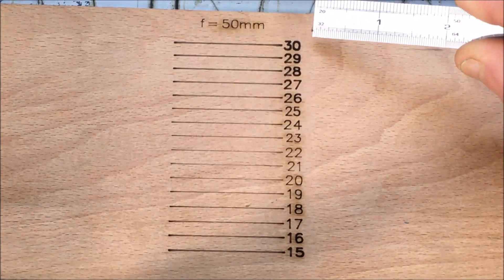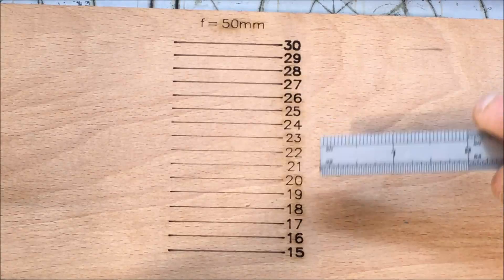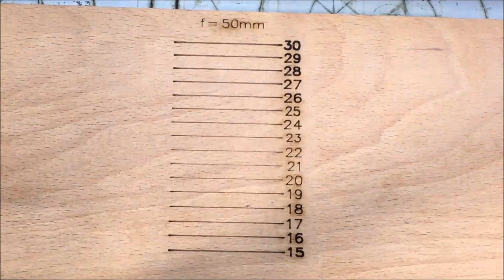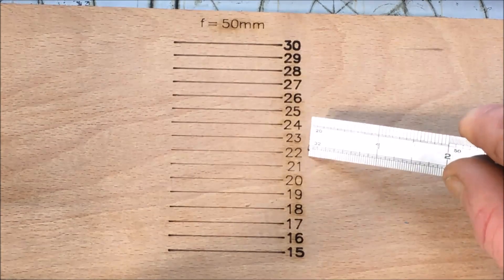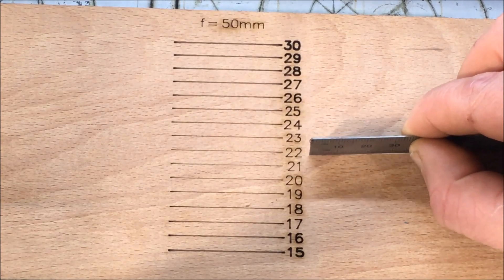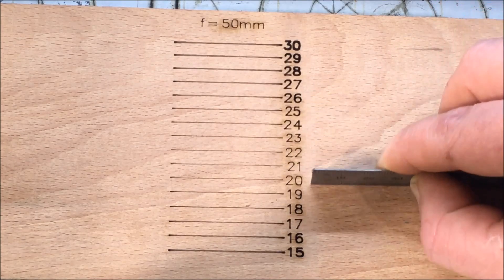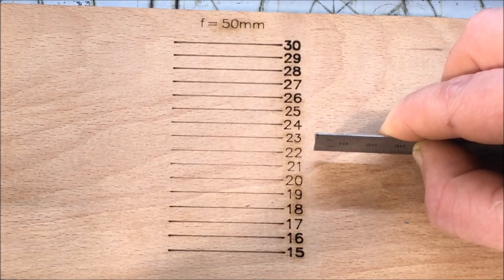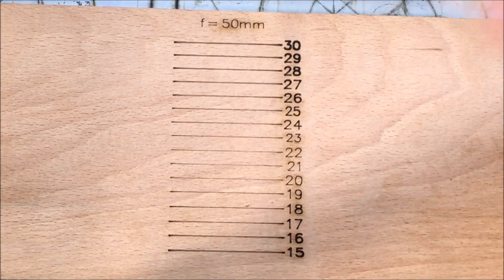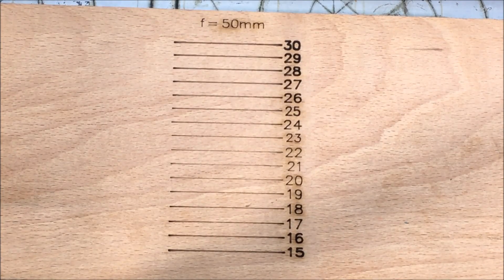What we've ended up doing is starting out of focus, going through the focal point, then coming back out the other side out of focus again. The two sharpest lines are around 21 and 22mm. I've cut myself a piece at 22mm and that's what I use for setting my laser. This 22mm is good for all kinds of surface work — engraving, marking, or scoring. The line is still fairly thin and we've got reasonable beam density between about 18-19mm and 24-25mm, so depending on how hard the material is we should be able to cut anywhere from about 6 to 8mm deep.